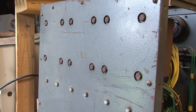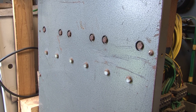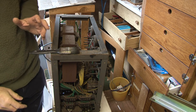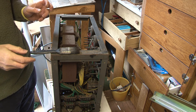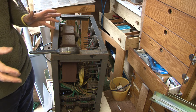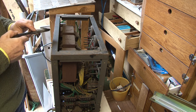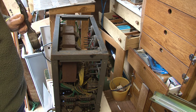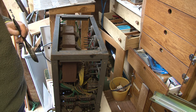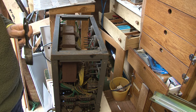Here's a shot of the rear of the unit. We can see these massive bolts holding the transformers onto brackets, and then there's a lower row of slightly smaller bolts holding the power resistors in place. Before I even think about switching this unit on, I'm going to do quite a lot of cleaning. I'm not sure whether to anticipate this working or going up in flames, frankly, because the selenium rectifiers are known for letting out the magic smoke in quite spectacular ways. So I'd rather deal with a broken unit in a clean state than try to fault-find something that's pretty horrible and then clean it up. This restoration I think is going to be more mechanical than electrical.